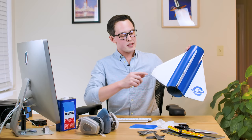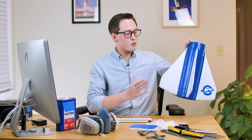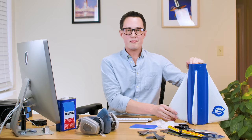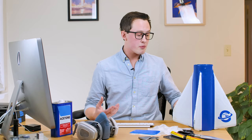The technique we're going to use is called tip-to-tip layup, because one layer of fiberglass goes from the tip of one fin all the way to the tip of another fin. We actually use more than one layer — there's one final layer on top that is truly tip-to-tip, with lots of smaller layers underneath that get a little smaller as you go toward the airframe. We need a layup schedule to help cut the right pieces and shapes in the right order. My friend Charlie Garcia, who has tons of experience with high-powered rocketry, recommended a seven-layer layup — completely overkill, but that means even with imperfect technique it should still be okay.